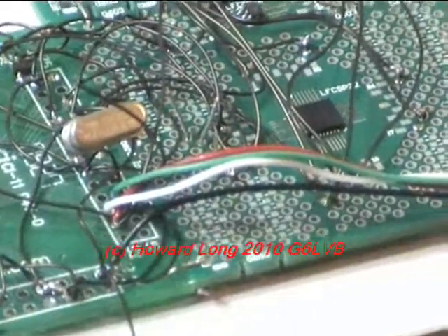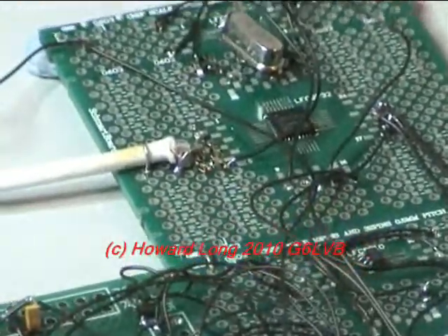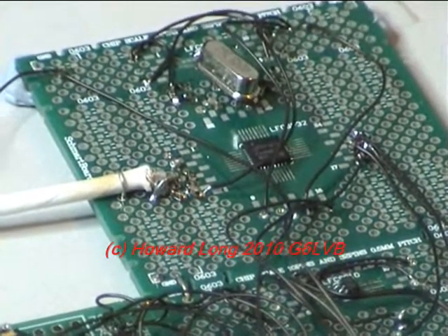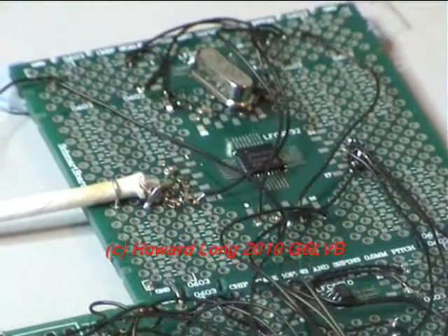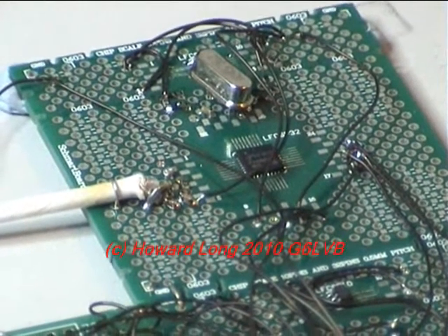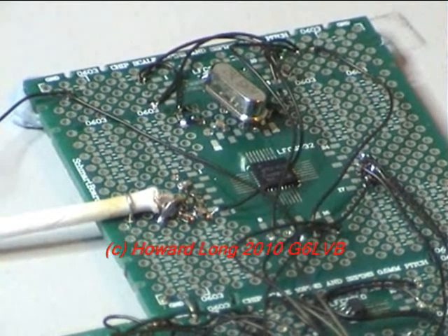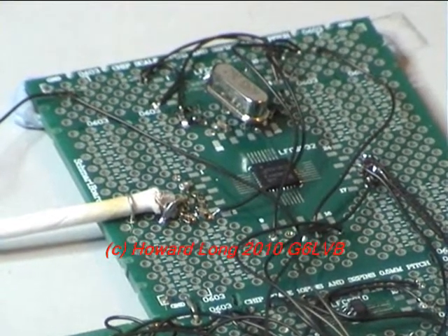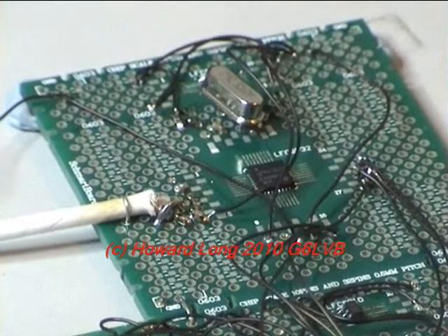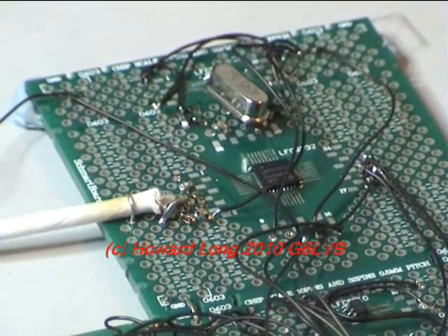What is new is: this is baseband, but what happened up here between the RF connector — your BNC — and what's going on here? Well, this is the neat bit. This is actually a DVB-T/DAB tuner, and it covers from 65 MHz up to 1.7 GHz. It has its own low phase noise oscillator, fractional PLL, and it will also do the mixing for you — down-converting to quadrature baseband. It has selective filters at several layers; you can adjust the bandwidth right down to baseband. There are also around half a dozen different gain sections you can control individually, all the way from the front-end LNA down to the IF in several stages.